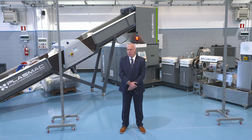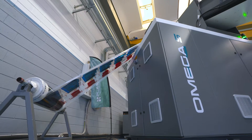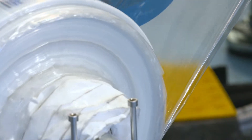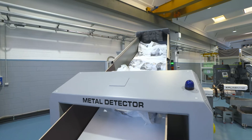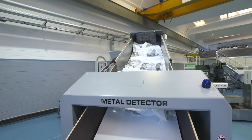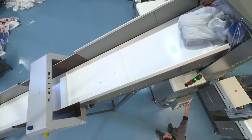The shredder size-reduces the material before it is fed into the extruder and then re-pelletized. The model you will see here is an Amiga S vented with water pelletizing system and we are running PE film scrap material. The material is being fed into the machine either via the elevator with integrated metal detector or via the roll feed unit.